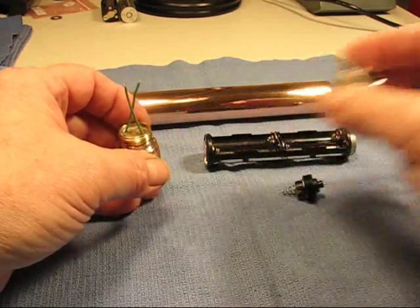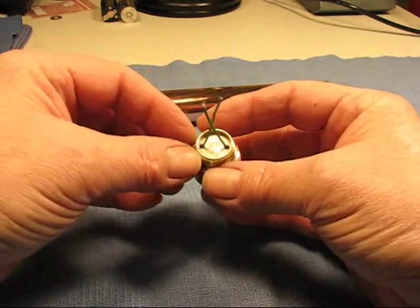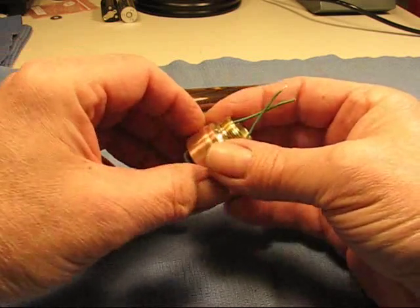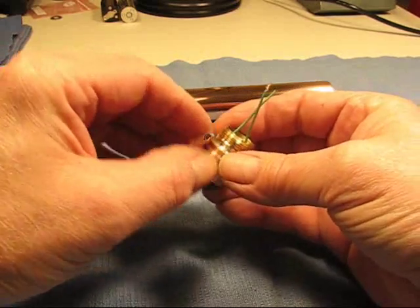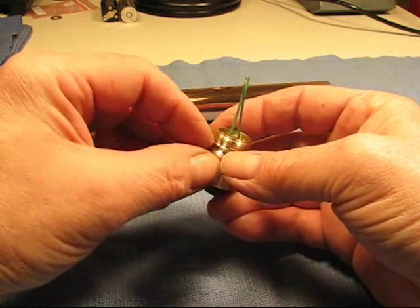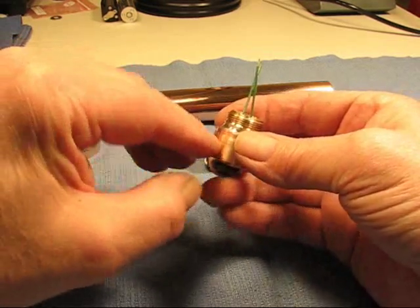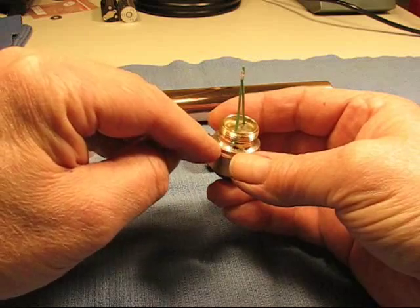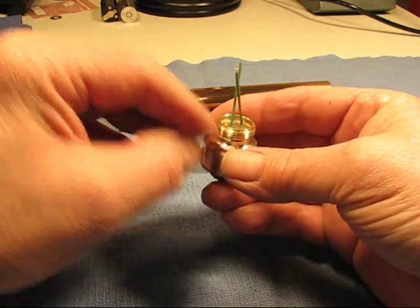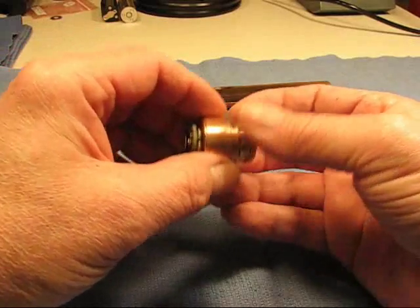It's an SMO reflector and I've done quite a bit with the heat sink. This is the pill — the top end where the emitter is going to sit. I started with copper fittings, basically all copper end caps: three-eighths, half inch, and three-quarter. Inside between those is a copper coupling that was cut and brought down to fit inside as well, so there's not a lot of solder — it's just solder holding it together but it's mainly copper.